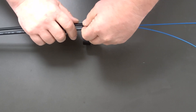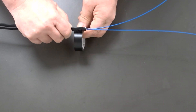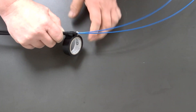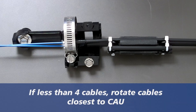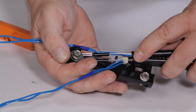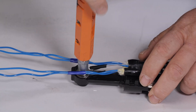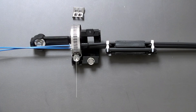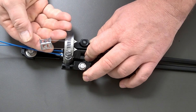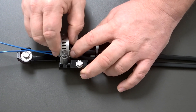Wrap the bundle with electrical tape where the hose clamp and spur bracket retain the cables. Once all cables are secured, install in the cable attachment unit. The rods on flat drop are not retained and can be cut flush. Secure any strength rods under the central strength member retention screw. Be careful not to trap or kink fiber tubes. Tighten the central strength member retention bolt with the can wrench. Install the hose clamp in the proper orientation and begin to snug the hose clamp. Install the spur bracket in the proper orientation. Tighten the hose clamp to secure drop cables.